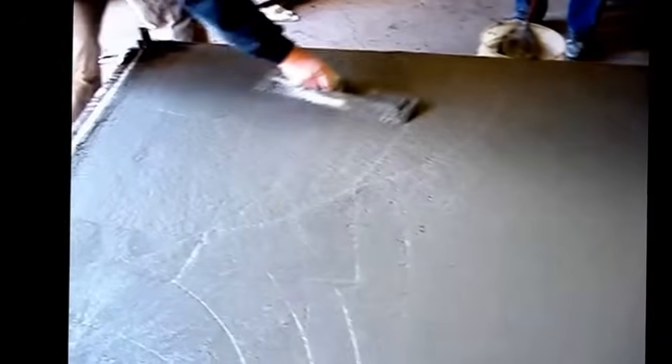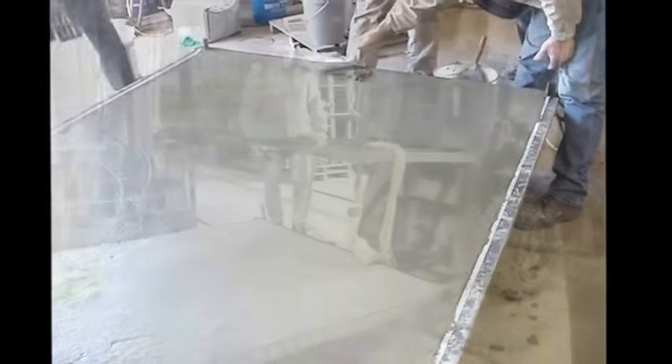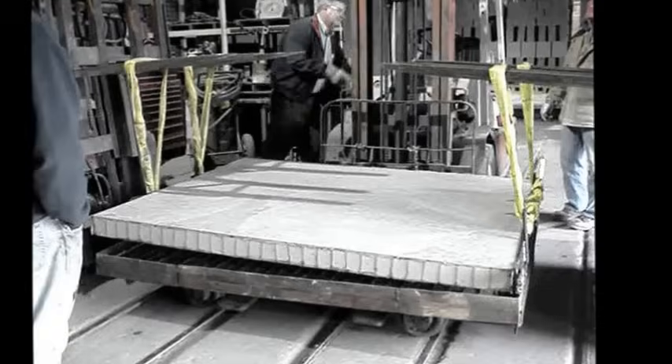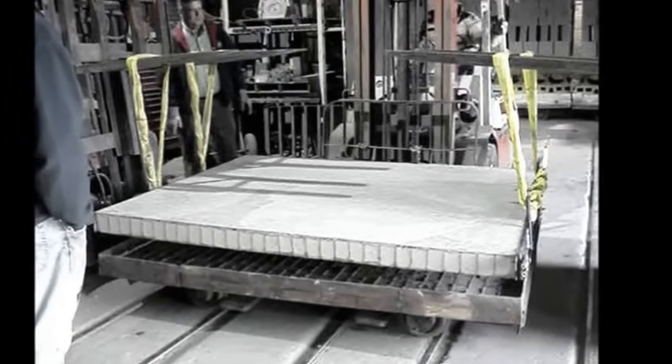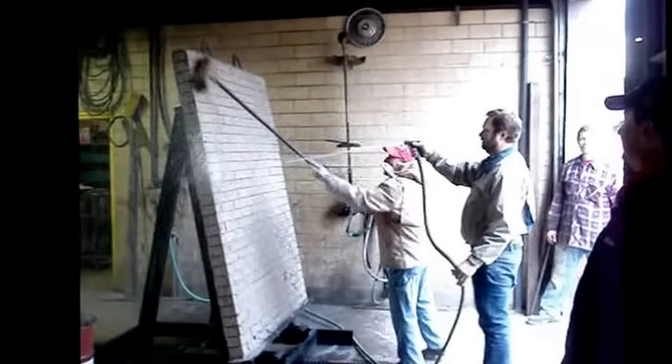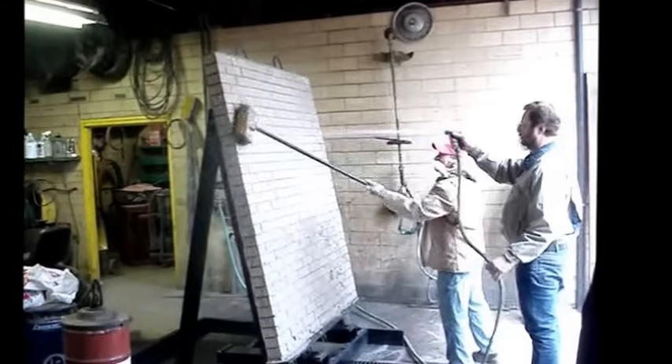Here is the smooth back of the panel. This was done on Monday, November 1st. On Friday, November 5th, we continued with the next stage, which was removing the now-cured panel from the mold. We used two forklifts and were glad that it stayed in one piece. We also noticed some paper clay down in the form liner here, and it was interesting to note that it still retained most of its moisture — it didn't lose a whole lot of moisture over the four days of curing.